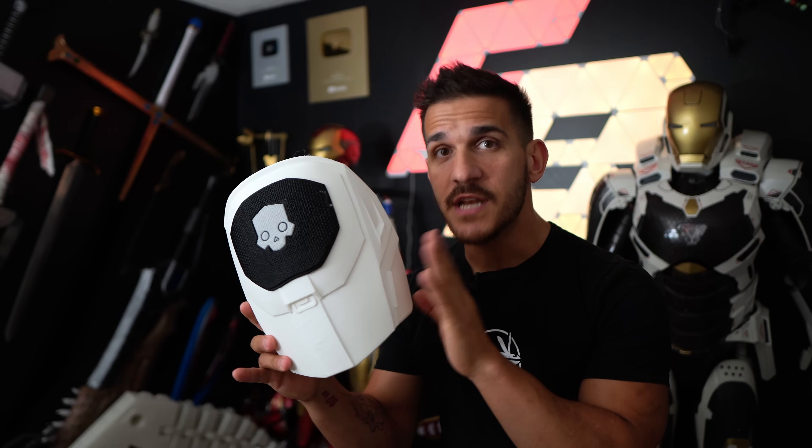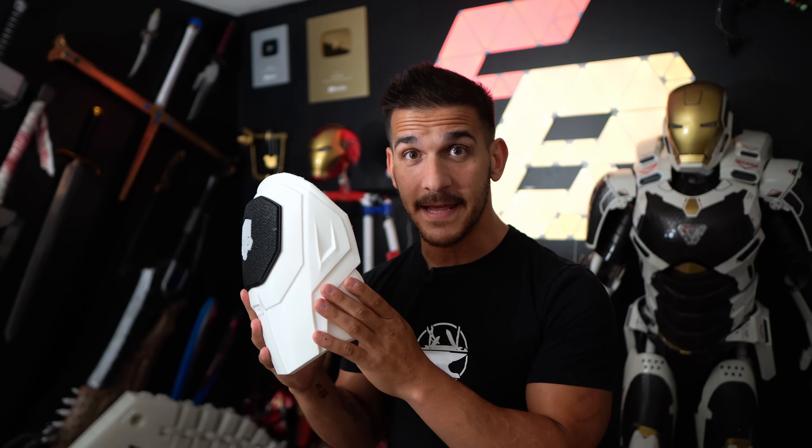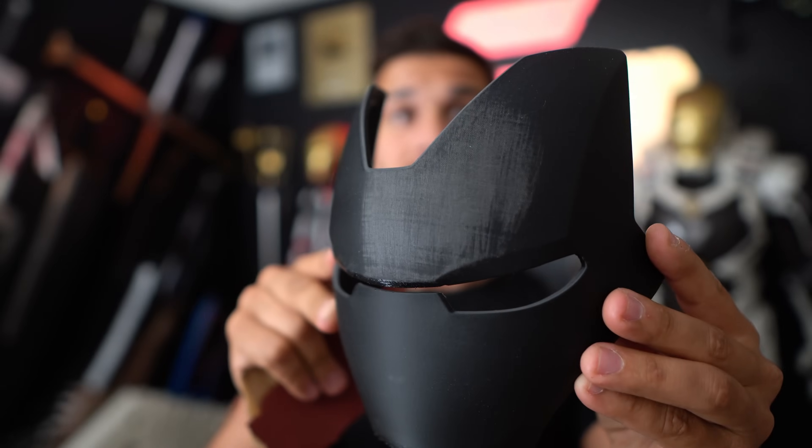The PLAs have worked out really well for this type of stuff. However, there are some colors I wouldn't recommend. When printing cosplay and props, I very much recommend reds, grays, or blacks — especially not light colors and especially not white. My biggest reason for that is you can't tell where you've sanded it. When it's time to start post-processing your prints and you start sanding, can you tell where I just sanded that? Because I can't. However, on a black, gray, or red print, you can clearly see where you've been over it and just how much more work you need to do to knock down those last layer lines.